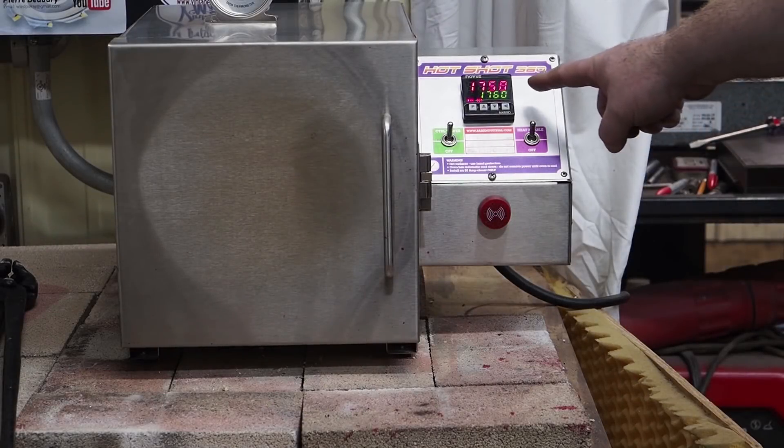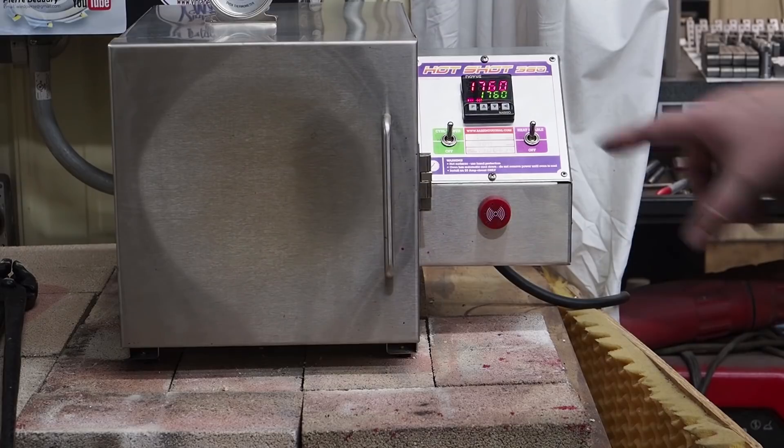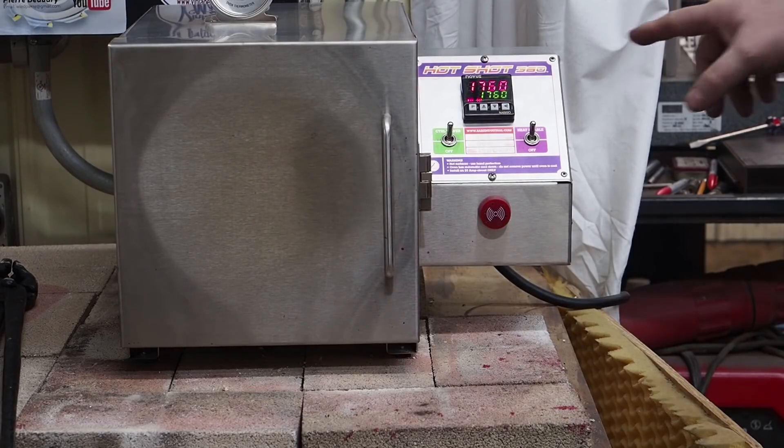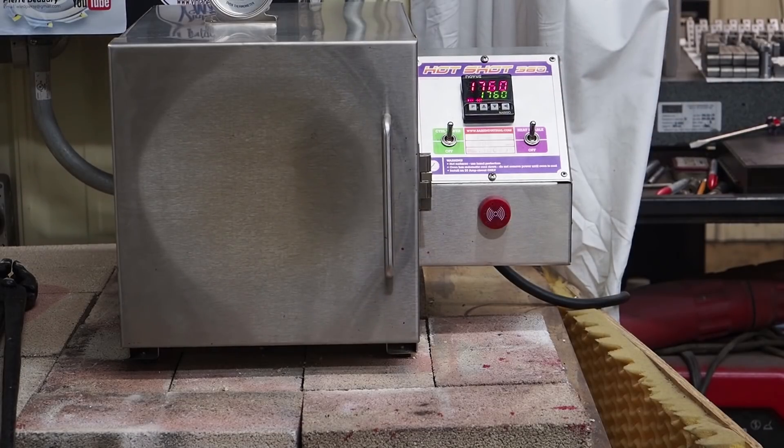You can see right now we're within two degrees of hitting our target — one degree. That took about four and a half minutes, so it was almost five minutes. What I think I'm going to do in that configuration file is change that to a 20-minute minimum, because most of the heat treat I do I start with the oven cold, and the whole oven will heat up and it draws energy. Once it's warm, the actual temperature can keep up with the target temperature a little bit better.